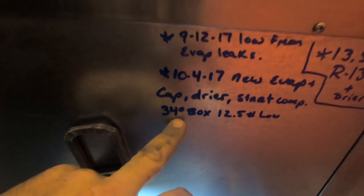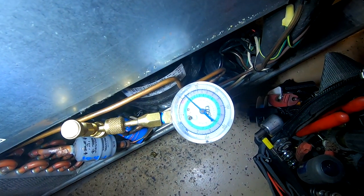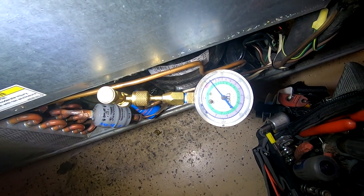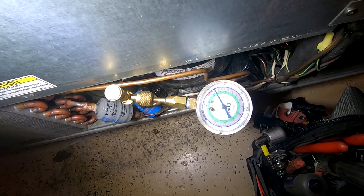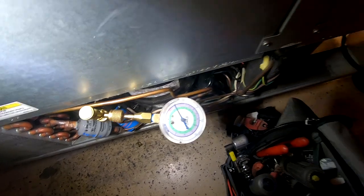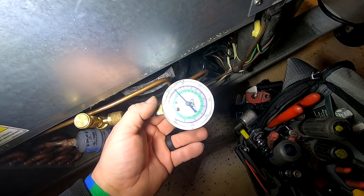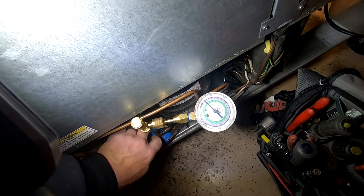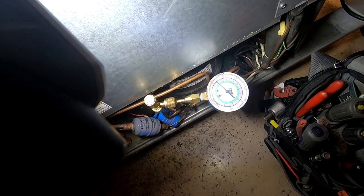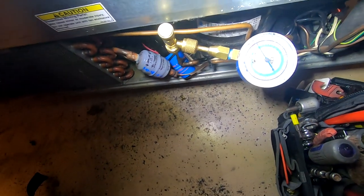When I first started this up, I noted a 34-degree box at 12.5 pounds suction pressure. That's kind of handy to know - gives me a reference point. This gauge isn't real super accurate at that low of pressure because it's a 300-pound gauge, but from what I'm seeing right there it's about 15 pounds, almost 20 pounds. My filter dryer there feels warm, which is a good thing. Coming down to a 5-pound suction, I'll let it run for a bit.